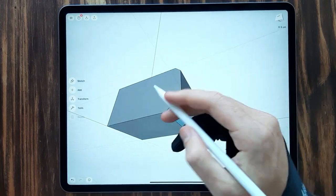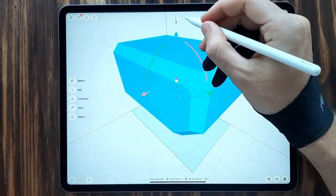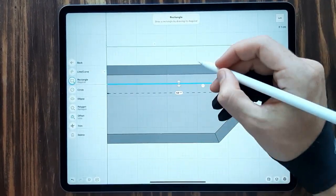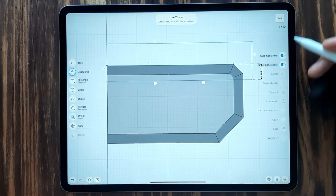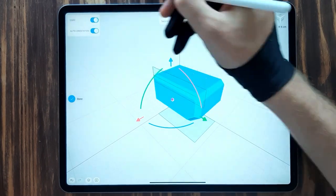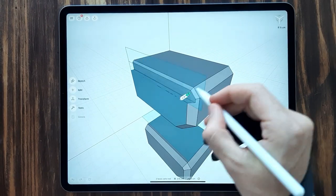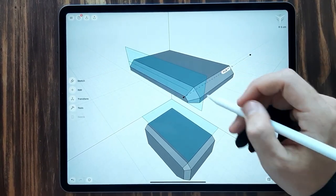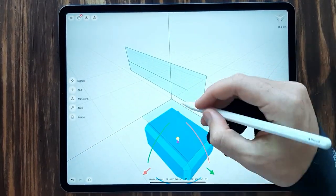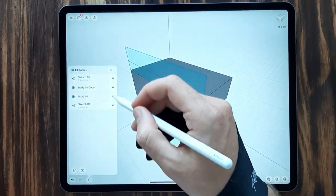Then I'm applying chamfers, an 8 one on the bottom, and the rest will be a 3 chamfer. What I do next is lift this body 15 centimeters, because I want it to be 15 centimeters from the ground, and I chop off the top of it. So I want it in two parts, the top and the bottom part. For this, I drew a simple square there as well. And before I cut through it, I double the body so I can reuse it. And then when I do the chopping off, I basically use intersect, because then I remain with a nice top part. I pull the body back, and then I can simply cut off the top part at this point.